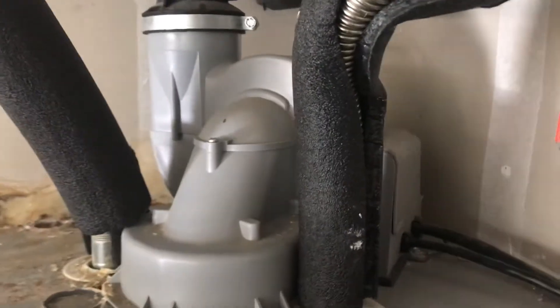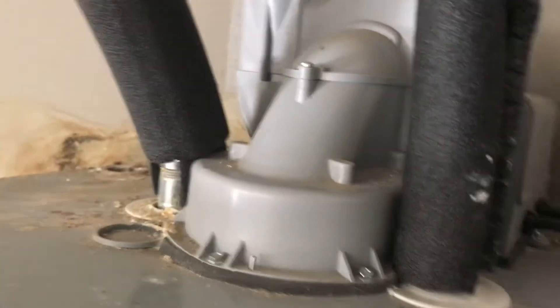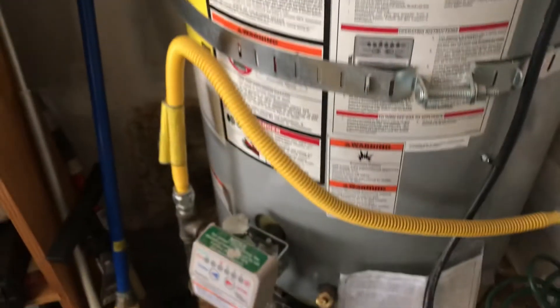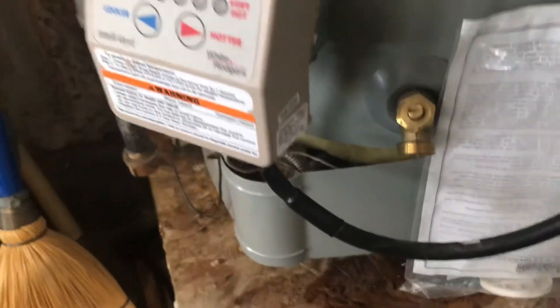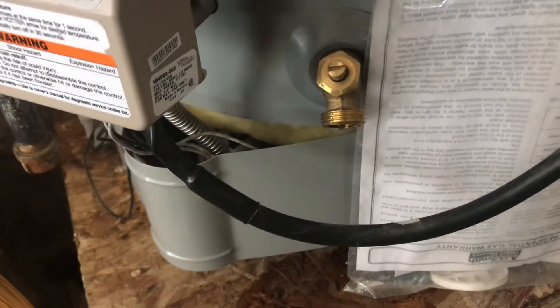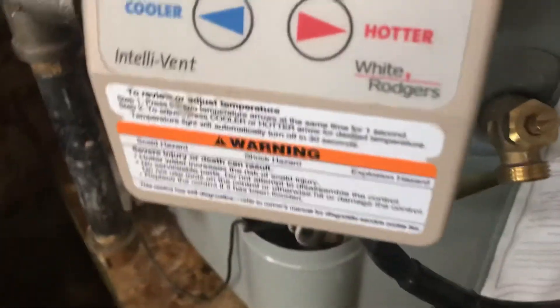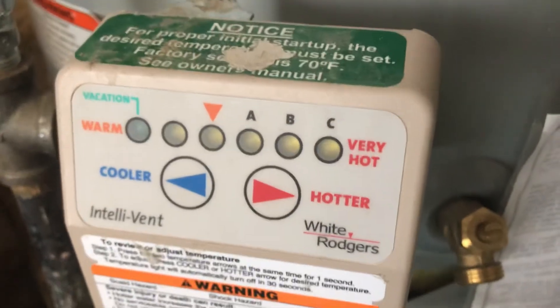In this county you need to have this blower on here. If it gets stuck you can just unplug it — sometimes it'll lock you out if the boiler on the bottom is not igniting. I've had neighbors say the burner plate down here is bad and it's been replaced under warranty. This is basically a White Rogers thermostat — I was going to yank it off and put a new one on because I thought the tank wasn't getting up to temp, but it was that mixing valve on top. The water heater was innocent, clear of any problems.